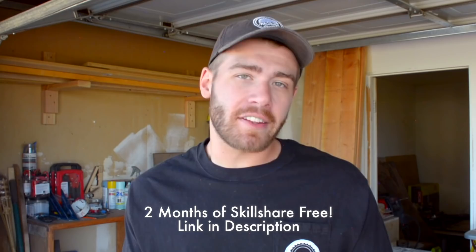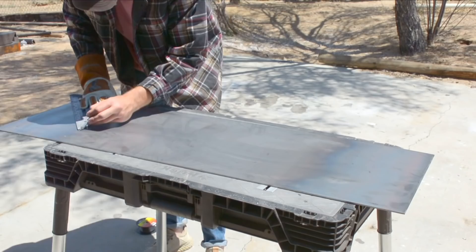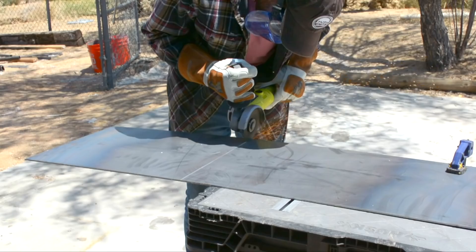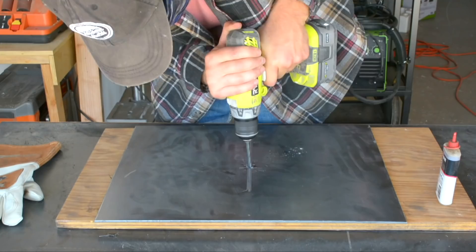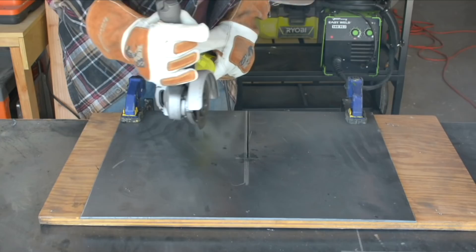I'm making the base out of 3/16 inch plate steel that's 16 inches tall and 48 inches long. After marking everything out, I used my angle grinder to cut it to length. The trick for cutting steel with the angle grinder is to do it in passes — the first one to establish your line, then go back and forth until you cut all the way through. I'll be making essentially a half lap joint out of this steel so that my two pieces are interlocking and really stable. After drilling a hole in the center where I wanted the joint to end, I used my angle grinder to cut a groove that is the exact same thickness as the plate steel, doing this on each piece so they lock together.